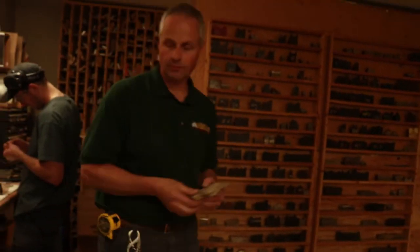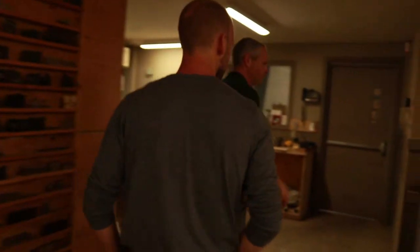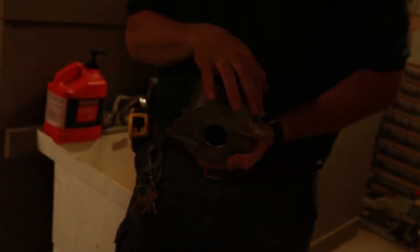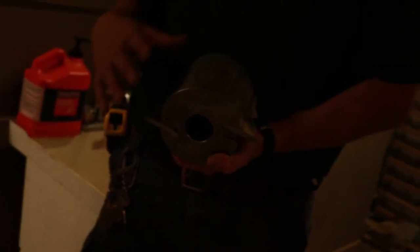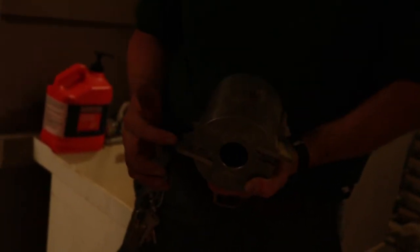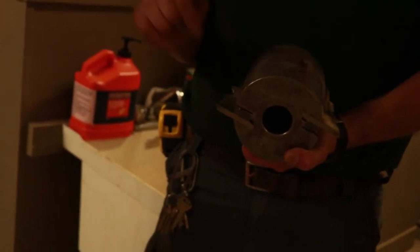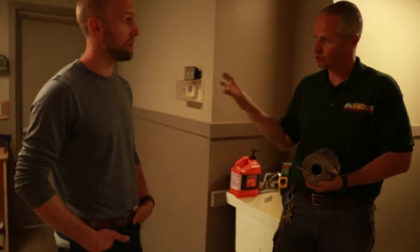If you come this way I'll show you what those heads look like. This is a head that is being used so there is a bit of gum on it — it will get cleaned before it gets put out again. It has got the two knives on. So we put the knives in the head, we sharpen the knives, we measure the radius minimum and maximum on a measuring stand, input that into the computer or the molder, and then tell the molder what size you want the finished product to be and it comes out that size. It will do it all in one pass, just chew it all out.